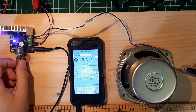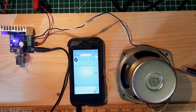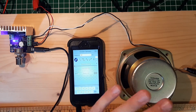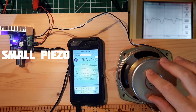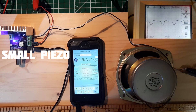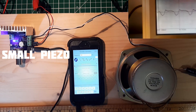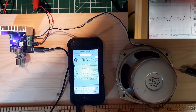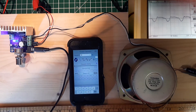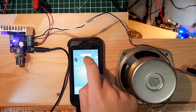Let's go for the 30 Hz frequency. I'll adjust the volume here because I don't want to burn the amplifier, and I'm going to lock it in place so each piezo gets the same volume from the speaker. So here we have the frequency at 30 Hz — we're in the 200 mV division, looks like around 300 to 350 mV. So I'll go with 40 Hz.